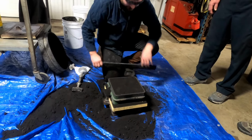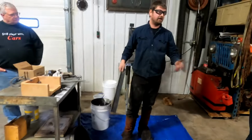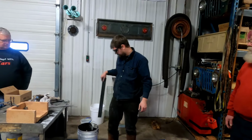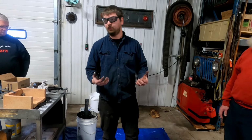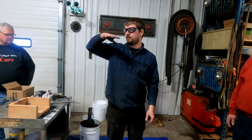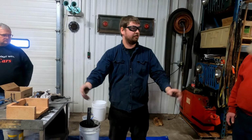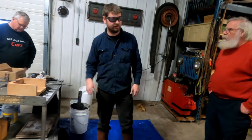And run it. And now, no one really cares about the backs of molds. Molders are always paid piece rate. You're not paid for the back, you're paid for the mating sand. The problem is, especially with this sand, if you don't have a flat enough back and an area to support it, when the metal hits, it'll burn the binder, and if there's nothing underneath, it'll drop out and all the metal will come out the bottom of the mold. Which is how that belt buckle that I was showing you earlier that I just charged failed.